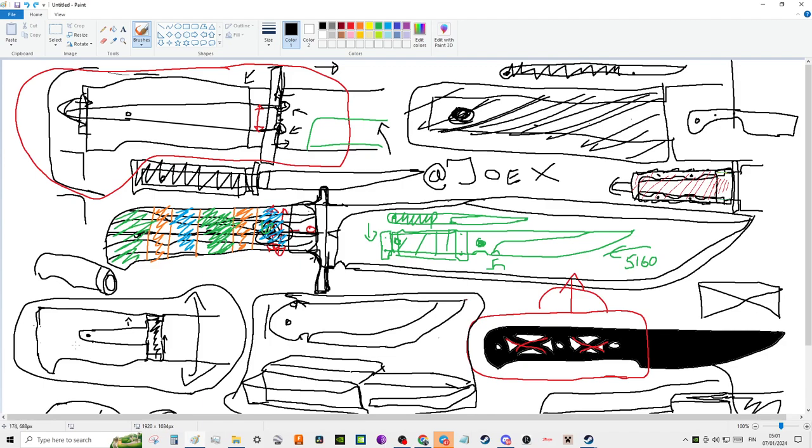You often see this on kitchen knives, right? Especially like amateur kitchen knives, you'll see just like this and a pin in the middle. I would avoid that, right? Because you don't need it. The glue will do all the work. Like the modern epoxy is ultra super duper strong. You'll avoid the wood shrinking being an issue where the pin starts to protrude. And then if you ever have a problem where you need to remove the blade or you need to redo the handle, that pin isn't going to stop you.